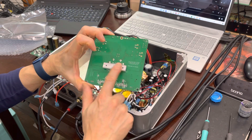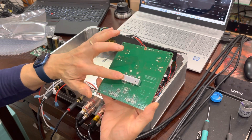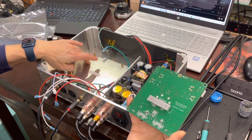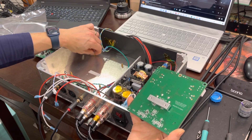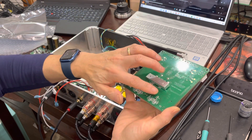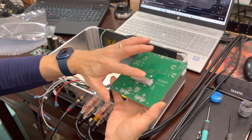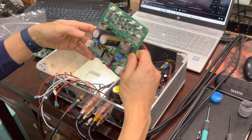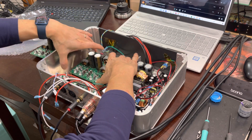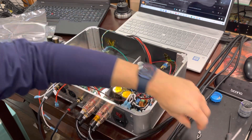The surface here is electrical ground to the board, so you want to isolate that from your amplifier chassis. I'm going to use a silicone thermal spacer pad — it's already mounted on the chassis. You will want 10 millimeter M3 brass standoffs. The height is critical because the 10 millimeter height plus the stack-up height of the chip and the silicone spacer will be a perfect match so that it holds it steady and gives you a nice thermal bond. I did calculate this so that it would be a precise stack-up height.